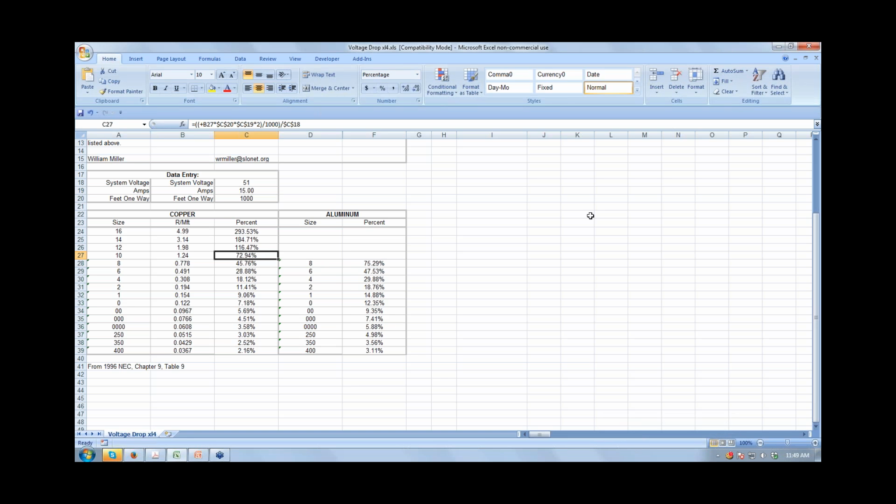Now this is on the PV circuit, or am I misunderstanding? Is this on the load side or the PV side? This is going to be on the load side. Oh, on the load side, different. Okay. Now your load is what, 24 volts or 28? 24. It takes 24. It converts the 24 to 28. Okay, so 24. And how many amps was that? What did you say, 3 before on the load side? 3 consistently, and maybe a peak of 10. Yeah, so you're still looking at about a 30% voltage drop.